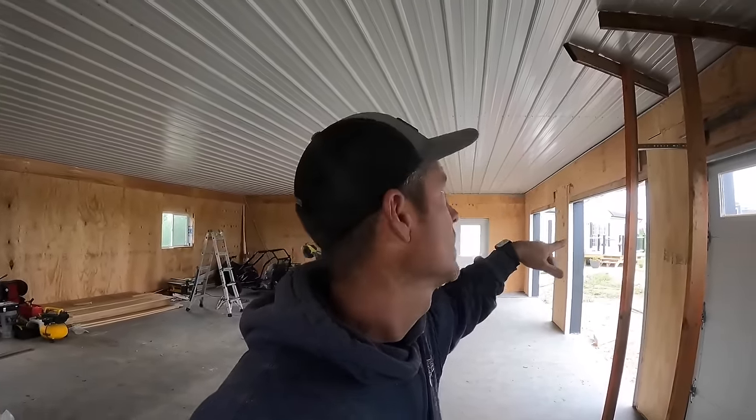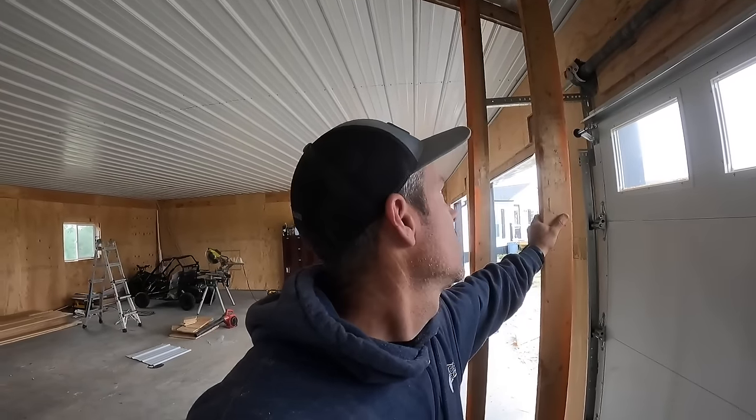if it's relatively low, 9, 10 feet, even 12, these T's out of 2x4s come in really, really handy. You can see from the video, it's like having an extra set of hands. So we were putting up 16 foot sheets. So they were covering two bays, and being able to take this and wedge it into the middle to hold the middle of that panel up to the bottom of the truss is crucial. And this is something I did when I did my garage. And I did a lot of that by myself.